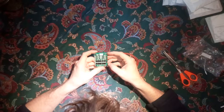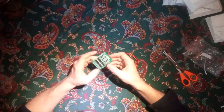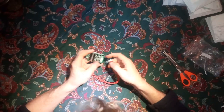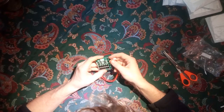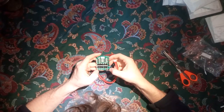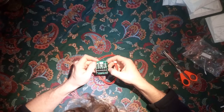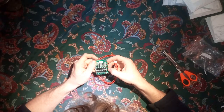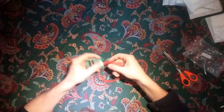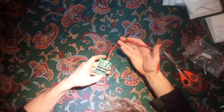So this one is B1, B2, B3, B4 — I believe this is a 4S battery management system. There are 1, 2, 3, 4, 5 wires there, so I believe that is 4S. It goes basically 0, 1, 2, 3, and then B-plus one here. It also included this nice little connector and cable. I believe this is a 4S 30A — yeah, it says 4S 30A.